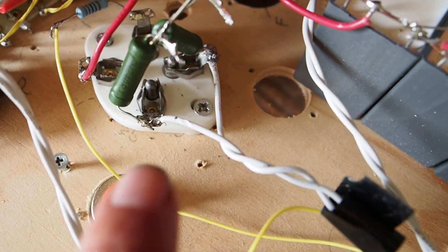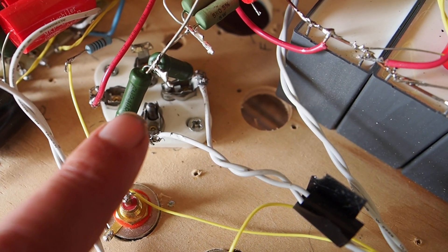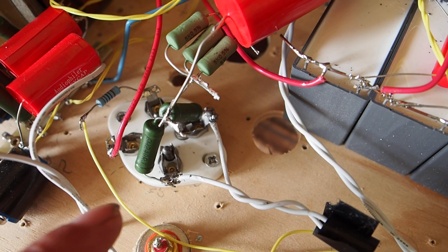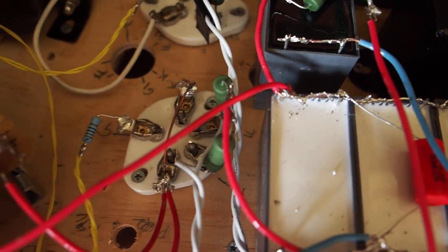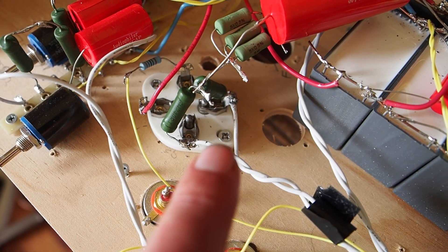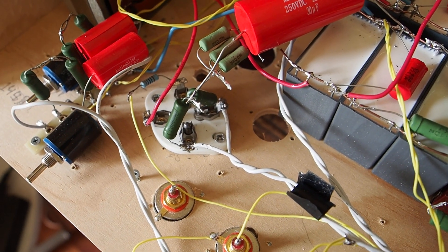What I've also done is use a balanced way of powering the filament, which means the cathode resistor is always a split load — the same matched resistors on each side. So there are two 15 ohm resistors. That means if there is any signal or noise in it, it will actually appear evenly over both sides of the filament, hopefully cancelling out most of the noise.